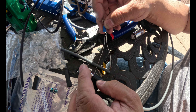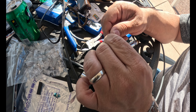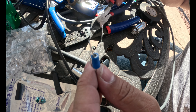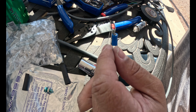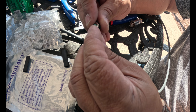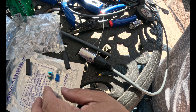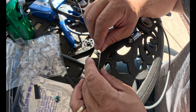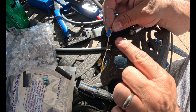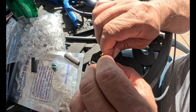Ed grabbed a longer piece of grounding wire from the old cord, just to be able to loop it around and make a strong attachment to avoid problems in the future. Make sure this still easily goes on — there's enough room — because the key is that this wire and this piece of metal touch the grounding. I've taken the one I had and twisted it around this one.